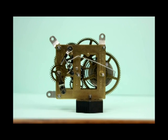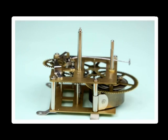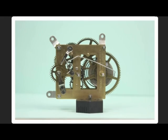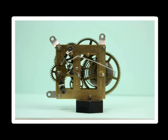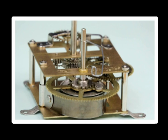Take photos of all 6 sides of the clock: front, top, bottom, left, and right sides. Take shots from at least 2 different angles, straight on and approximately 45 degrees. A straight on shot shows a vertical post as a single dot, which is difficult to distinguish from a pivot. A shot taken from an angle will clearly show the post. Make sure that you get a good shot of the mainsprings and the direction they are installed, as well as the clicks and ratchet wheels.